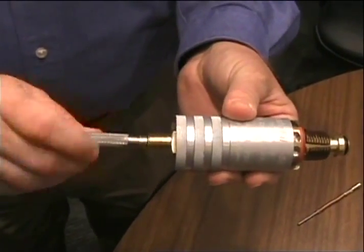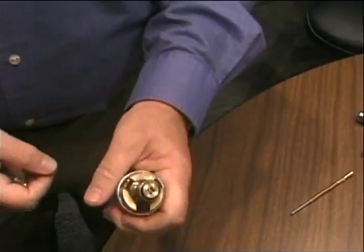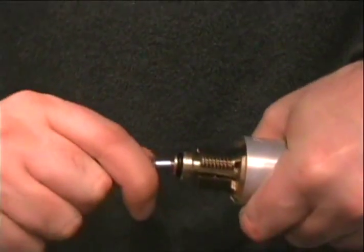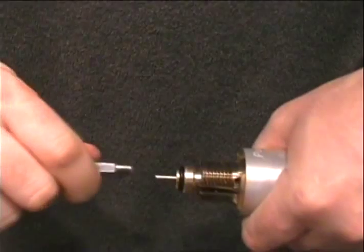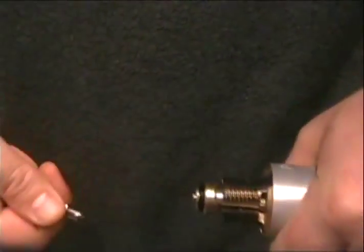The conversion process is simple. Step 1: remove the plug from the back of the connector with the RPV key. Step 2: insert the RPV pin and tighten. Step 3: push the sleeve to the open position. Step 4: using the RPV key tool slotted end, release the pin to the open position. If using with a CGA 540 valve for oxygen, the pin will remain in the fixed position and is not retractable in the field.